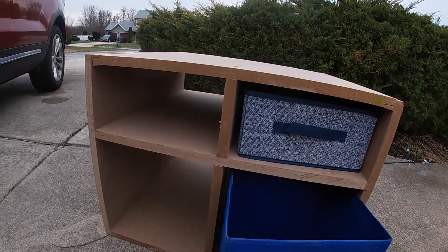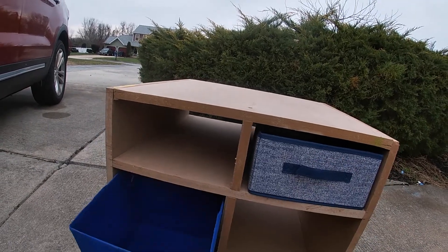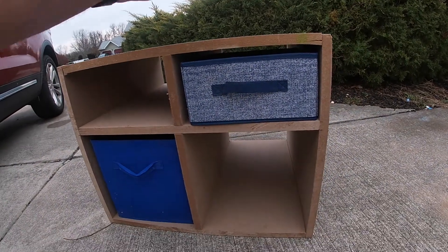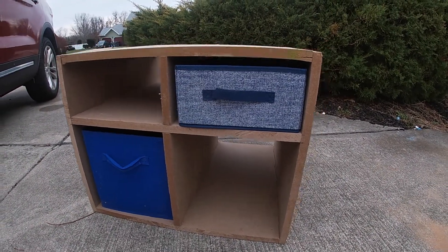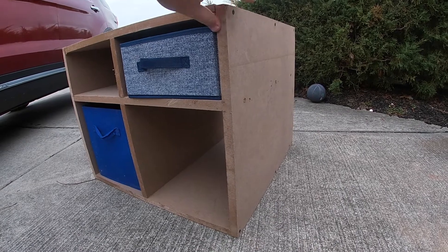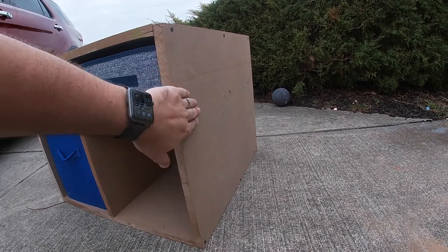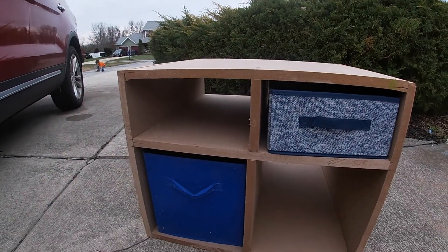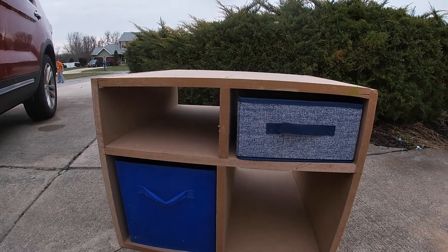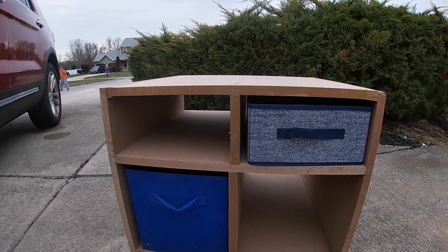This gives you an idea of what it looks like. We have these little fabric drawers that all fit in the holes — they can put their Legos in here, and there are four over here and four on the other side. This does have to be painted. Once I shore up the nails, I'm going to countersink each screw, pull them out, countersink and screw back in, put a little caulk on it, and you won't see the holes. Then we'll finish nail it all around, paint it, and once we're done painting, we can build the top.